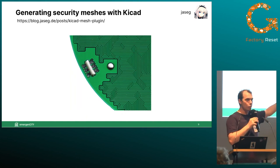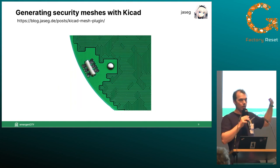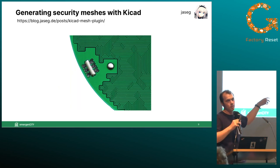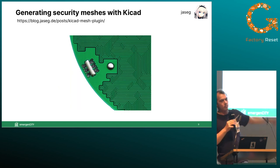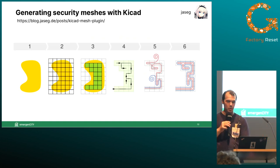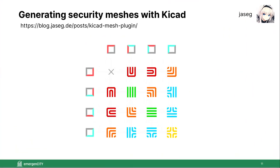There are only about 15 possible tile patterns at the end of the process — you look at which sides of your grid tile connect to adjacent tiles, then use a lookup table of shapes to connect the two traces to match that connection pattern. By puzzling together these shapes for an entire PCB you get two continuous lines. You can generate these for irregular shapes with different levels of randomization — on the left, always choosing left gives a regular pattern; towards the right, increasing randomness makes it look pretty, which isn't super technically useful but looks nice.